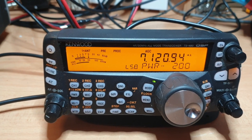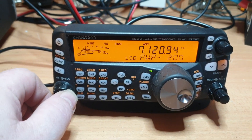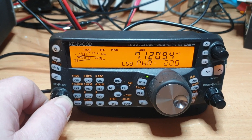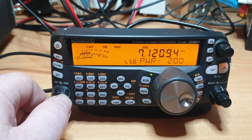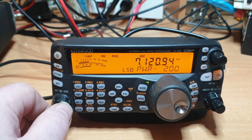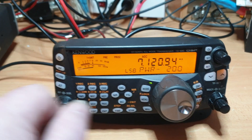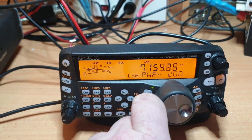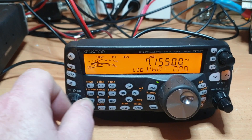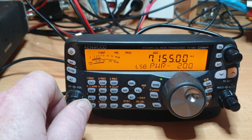Actually the processor — when you see that — oh that pushes it a lot harder. The only thing I'm a little concerned about is I don't want to transmit too long on this one, as the SWR may not be quite where it should be. I don't think it's astronomical but I think we're seeing a bit of fallback onto this antenna, so just a very much short quick test antenna this one. But having a listen around — we're in for a noisy night tonight, definitely.